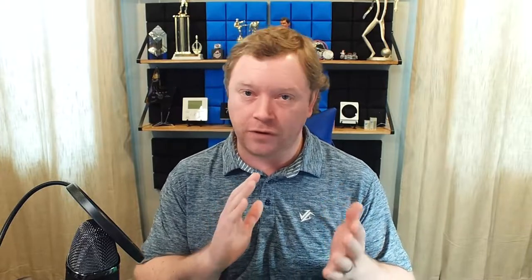It's important to note a couple of things as we jump in. There are multiple box sizes. The smallest branch box is a single-port box, and we're not talking about the single-port box in today's video. The whole purpose of today's video is when you have multi-port boxes with line sets hooked up to all those boxes — sometimes you have empty ports, sometimes you're twinning a set of ports — and we need to know when to turn on dip switches and which dip switch to turn on. The smallest multi-port box is a four-port box.